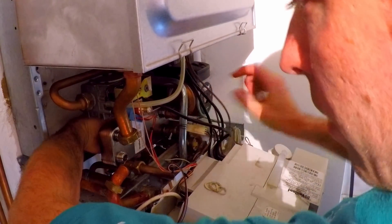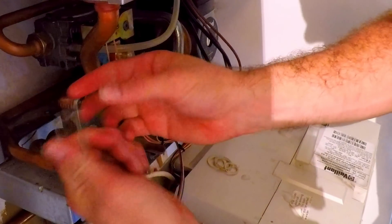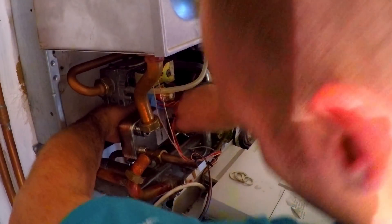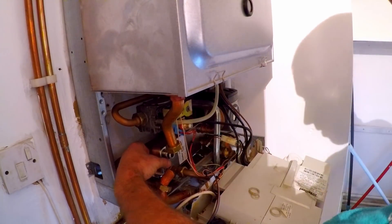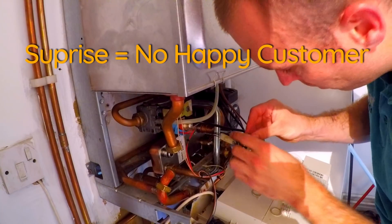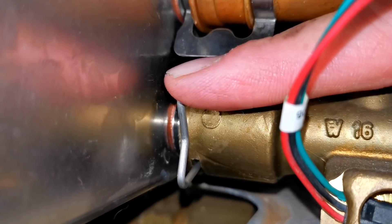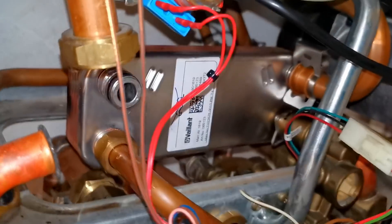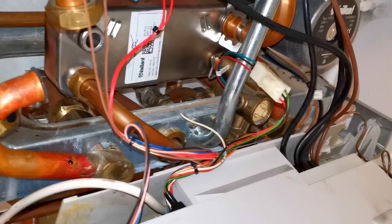The aqua sensor felt like it went on. Get the clip, squeeze it together a little bit, make it just a little bit tighter than it was. I'm going to push the plate onto the aqua sensor and put the clip in. Now without doing anything else I'm going to try and push it off — doesn't come off, it's safe, that's not going to pop off in the middle of the night and flood the house. Do this connection to the plate first and try to force the plate off it to make sure it grabs. Now I just need to get the diverter back in.